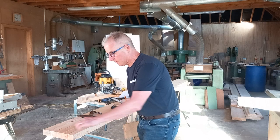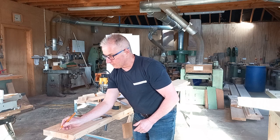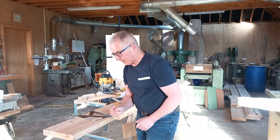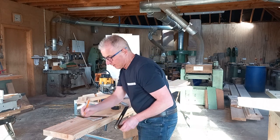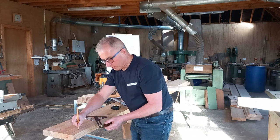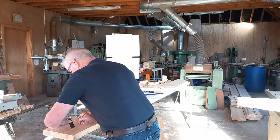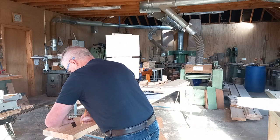So that's the skirting board and that's the floor line. And the angle is 90 degrees there. So now, the fact that we have that point, right there, that's the identification of where the first rise will go. So we can put a line back up here and put a line back up here.